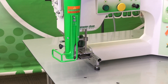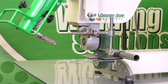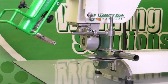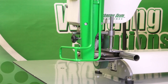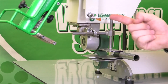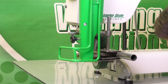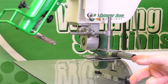Then I'll check again — swing it in, swing it out. Now that we have our two positions locked down and our guide is stable, we are going to try to get the inside of this wedge to the inside of this wall. As I swing it in you can see we have a pretty big gap there, so I'm going to eyeball that gap and move the guide to the left to get those two surfaces closer together. I'll hold the guide, loosen it, swing in, lock it down — and there it swings right in against that wall. You need to get down here and look through this hole to see it actually touch.